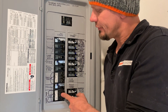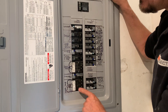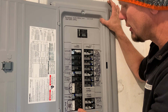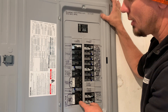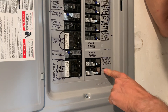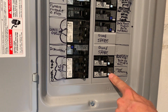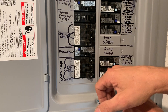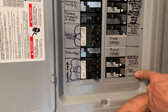Keeping in mind, these quads are going to become a little bit more obsolete. Unless you're doing like an AC and a cooktop, you could do a 50-30. I do like Siemens because they have 50-30, 30-40, 30-30, 35 — so many different options of the two-pole as well to kill the double phases. Getting into here, you've got your crawl space. Crawl spaces don't have to be arc faulted, but that's all I had left on the truck. You do have to GFCI it. It's actually cheaper for me to get a dual function than it is a GFCI in Siemens, so I just like to arc fault it anyway — but you have to because of lights.